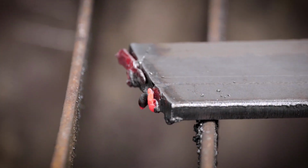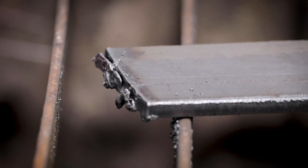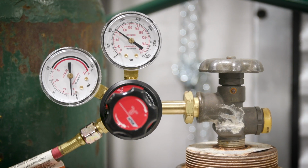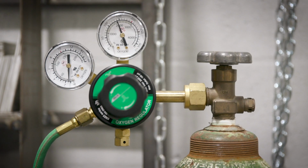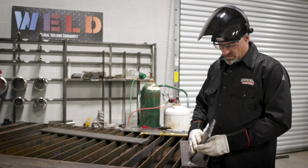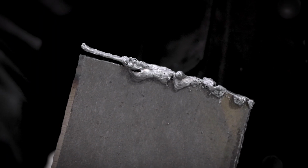So this is the case that Ashley looks like she's having. As you can tell on the gauges, I'm really low on the propane and really low on the oxygen, and I was moving too fast. I hope that's what you were getting there. So I showed you the mishap that we had about traveling too fast. It welded itself back together. The gauge is not adjusted correctly.